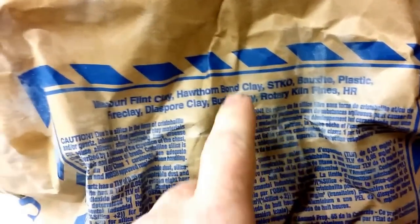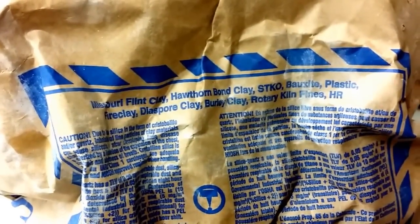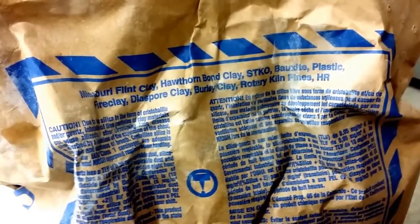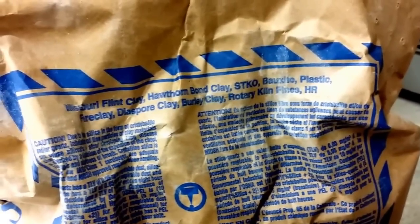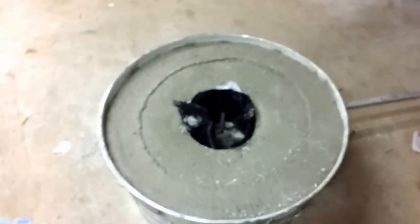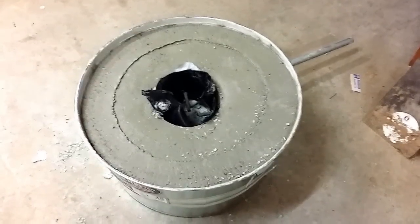We'll use the vermiculite for the garden this season, so it won't go to waste. The fourth component after the perlite is fire clay. If you buy it from a ceramic supply store it will often not even be labeled fire clay — it comes in different grades. I just told the folks at the ceramic supply store in Nashville what I needed, and this is specifically Hawthorne bond clay, also known as fire clay. It is the most important component of making a refractory furnace because it is designed to harden as temperatures rise higher and holds everything together, keeping it from cracking under high heat.